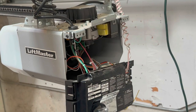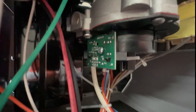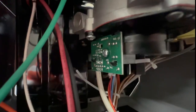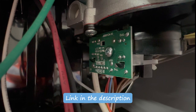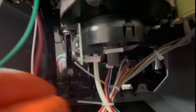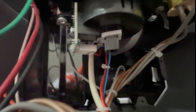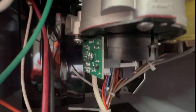This is the view inside the garage door opener. This right here is our RPM sensor — you can see it's got one little Phillips screw and a couple of little clips, but it'll pop right out. On the bottom is where it plugs in, you can see that right there. At this point all we've got to do is unplug it, unscrew it, and replace it.